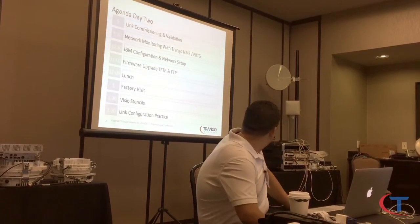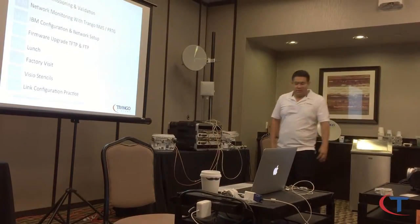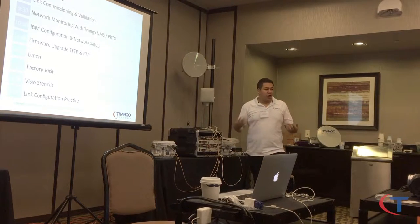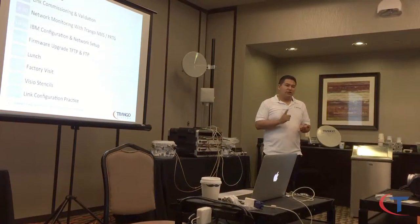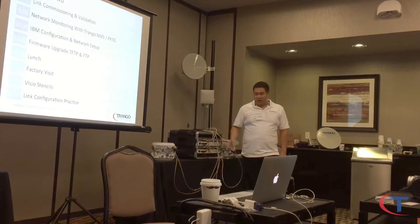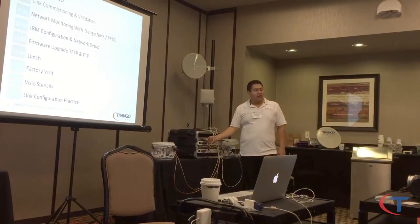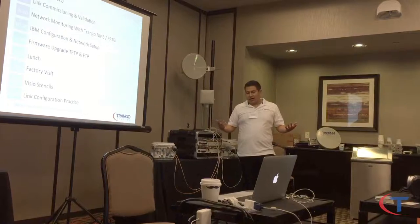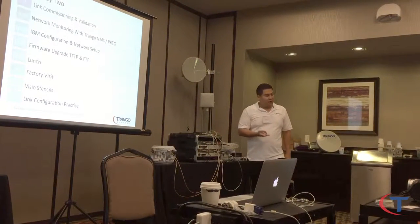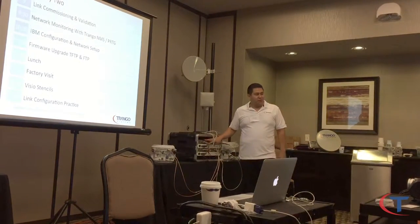When testing with the voltmeter, you're testing the pins on the end connector — not the IDU itself. If you blow the fuse, the IDU will still power on and you can access it for management: change IP, SNMP traps, passwords. The only thing that won't work is your ODU. There's a fuse here that protects the IDU from negative 48V discharge or heavy load. There's also a protection diode inside — so if you invert the DC negative 48V polarity, it will not burn up.